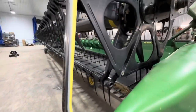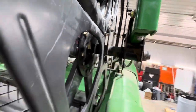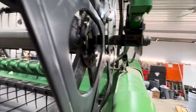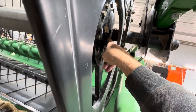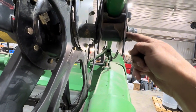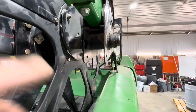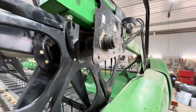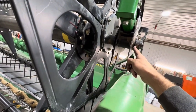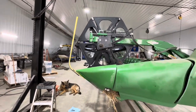Got it all bolted back together — went fairly well. These reel pieces are a bit of a pain, but it all worked good. I just had to make sure that was in the same pinhole as the other side so that all the fingers were the same orientation. The only thing I did wrong on the whole job is definitely them spacer washers — I needed to put two in there instead of three, because it pulled this inner part of the reel in, and then that half moon keeper — I couldn't put the washer on the inside of the keeper, and I know that's not the way it's supposed to be. I'm leaving it that way because this thing has to be out in the field in another three hours today. This winter I can take it all apart again and put two spacer washers in there and have this washer on the right side of that keeper. Other than that the job was fine — she's ready to go back to work. Hopefully that helps somebody. Have a good day.